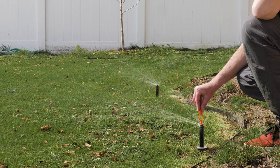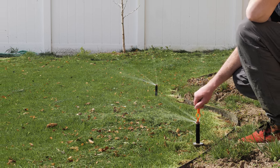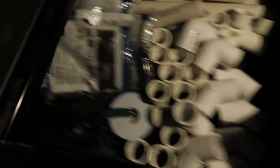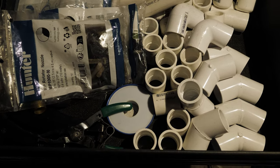Sixth tip: fine-tune your system. This is the time to go through and make adjustments to your impact sprinklers, rotary heads, or rotator heads — whatever equipment you have. Make those fine-tune adjustments, adjusting the arc and the radius to make sure you've got proper coverage. Bonus tip: make sure you have more than enough parts going into the lawn season. Buy more than what you need so you've got it on hand to fix any issues right away. Hope you enjoyed this video — thumbs up if you did, let me know in the comments what issues you've had and how you fixed them. Make sure to subscribe and I'll catch you in the next one.